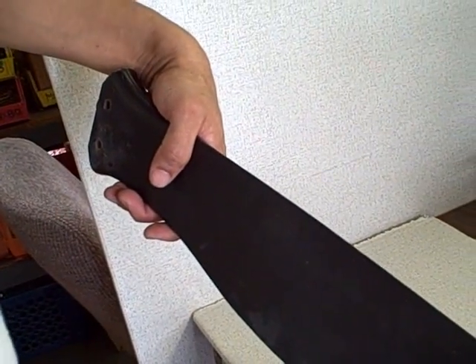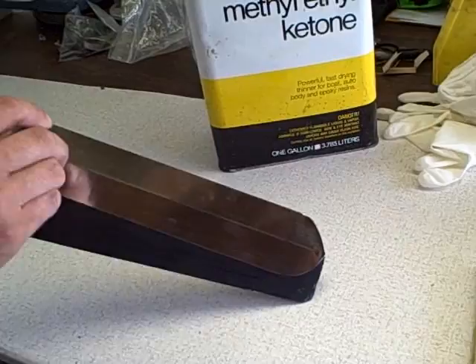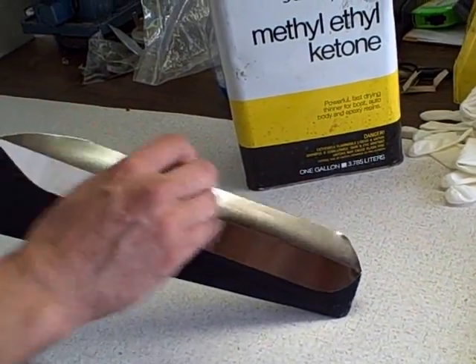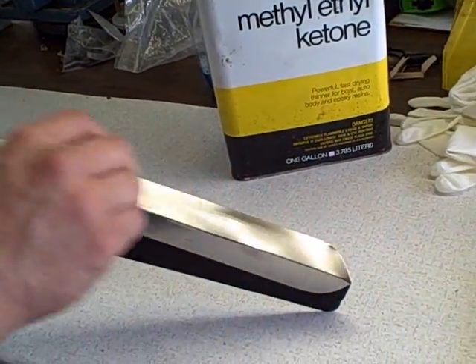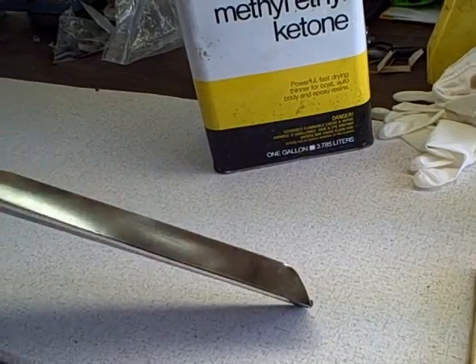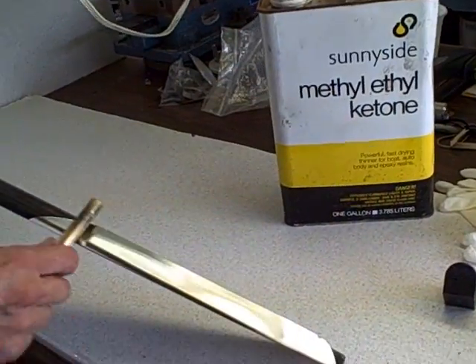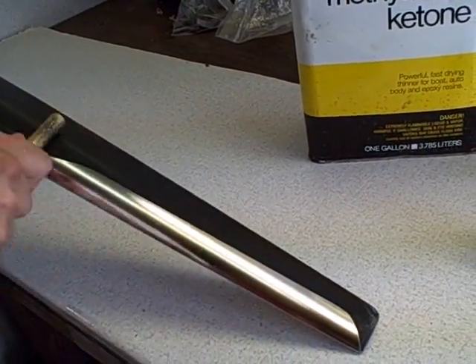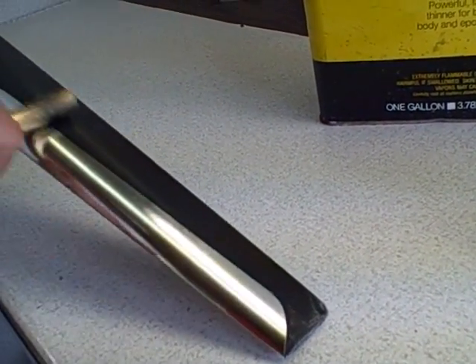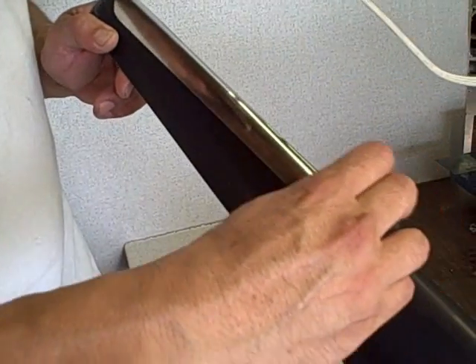Notice how he's holding the blade close to the root — this is the proper way to hold the blade when you're going to start putting it on the curved side. Now start rubbing on the beginning of the leading edge, working it over the leading edge to the curved side. It's best to use a piece of nylon or brass to slide back and forth along the leading edge. Gradually continue tilting the tool toward the trailing edge, sliding lengthwise along the curved side, pressing the tape without wrinkles.